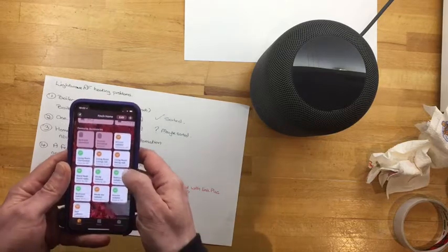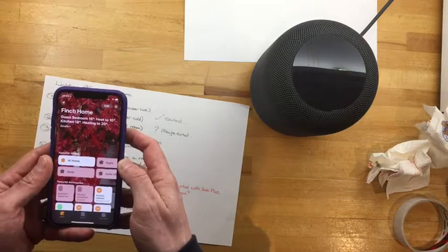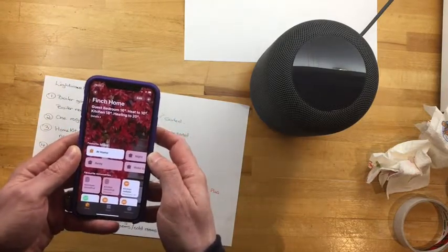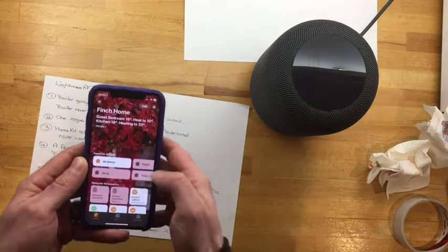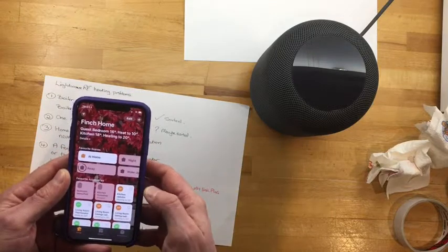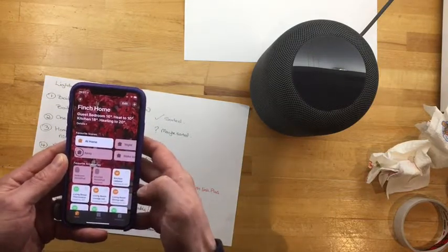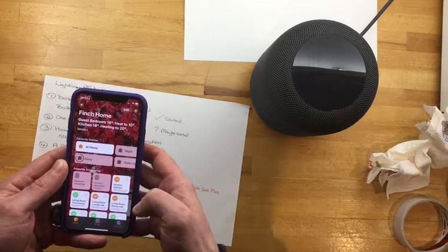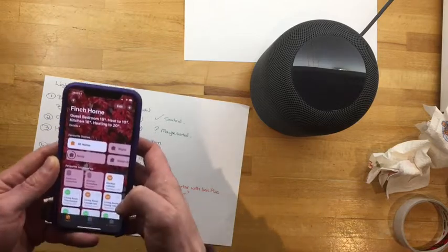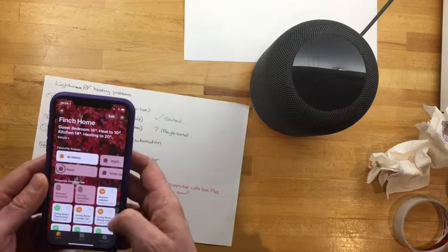The problem being, I've got it in the at home mode. I kind of tried to get into a stable state before I showed you this, is that it just never seems to work fully. It'll always work on a few of the radiators, but not all of them, and it's a bit random. So just to demonstrate it, if I do the away scene, it'll sit there and rumble away. And this away scene sets virtually everything back down to 10, is how I set it up. You might be able to hear the radiator valves running away in the kitchen here where I'm at, so it's clearly doing something.